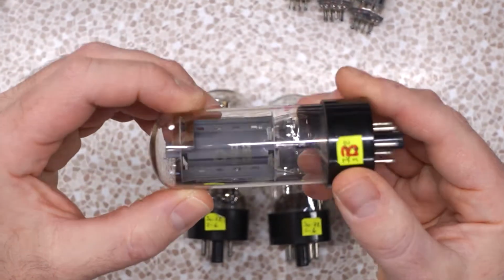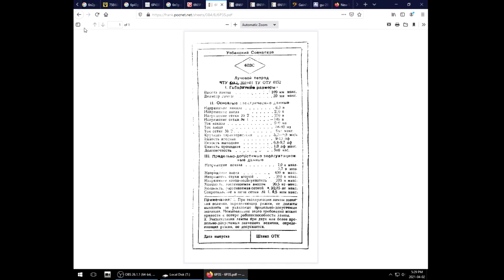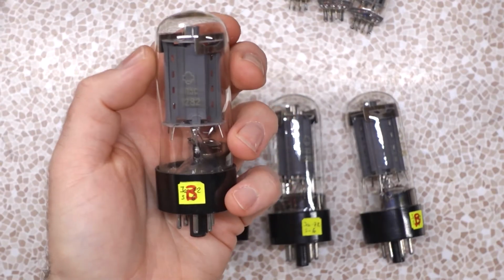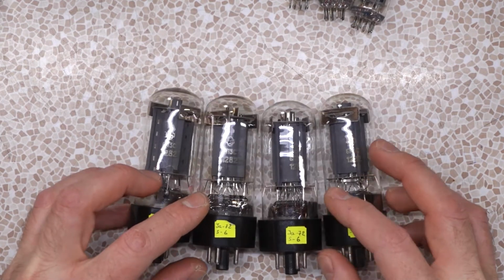we have to call shenanigans on that, because they have a maximum voltage rating of about 350 volts and a wattage rating of 20. Oh, frick, look at this archaic. Oh, they might actually only have a maximum voltage of 250 actually. Or no, maybe like 400. Either way, if you bias these and set them up as a 6L6, they red plate. However, I've tested them in my various amplifiers and I've gotten them to work just fine, provided I bias based on 20 watts on that amp. Anything higher, starts glowing. Now, power tubes are always fascinating because they add a lot of taste to your tone.